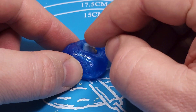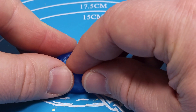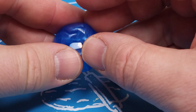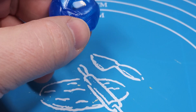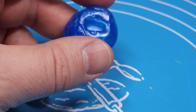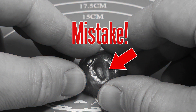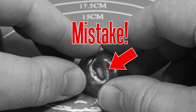As I said earlier, this is my first attempt and it's around about here where I made my first mistake, because I didn't leave the part in there and I didn't allow time for the thermoplastic to harden again. I just removed it straight away, and of course what happened is the plastic was still pliable and this little hollow just collapsed in on itself.